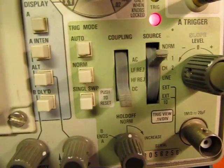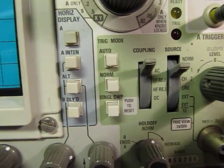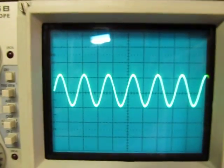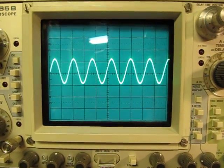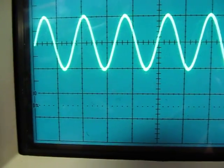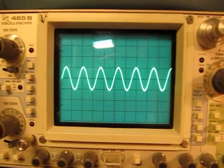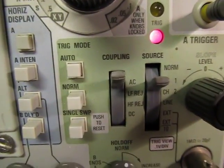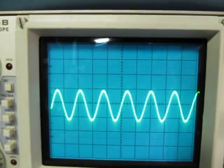You may actually want to trigger on the signal regardless of where it's sitting DC-wise. The other very common trigger coupling control to use instead of DC coupling is AC coupling. If I move to AC coupling and set a threshold in the middle of the AC signal, regardless of its DC offset I'm still triggering on it, because AC coupling removes the DC component of the signal and I'm only triggering on the AC component. That cutoff frequency is typically around 20 or 30 Hz, so anything above 20–30 Hz gets coupled to the trigger circuit.